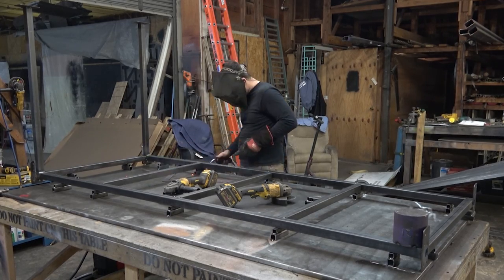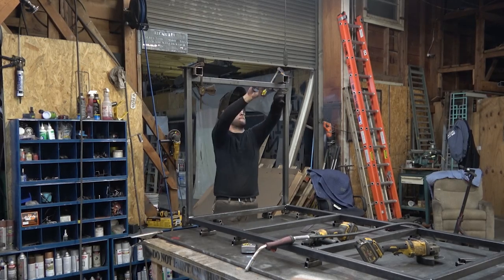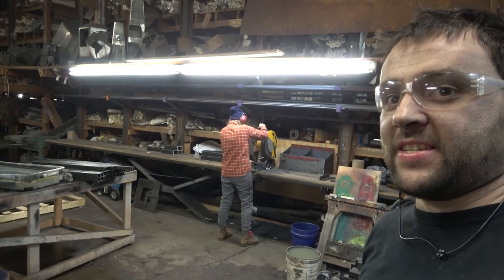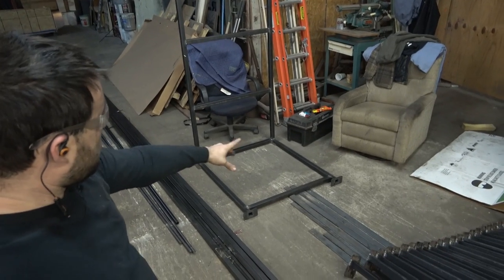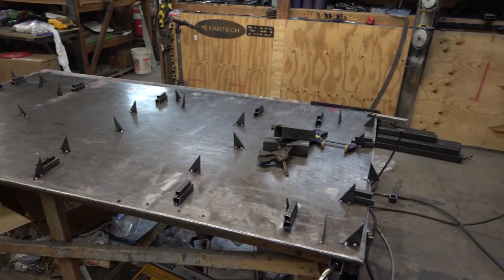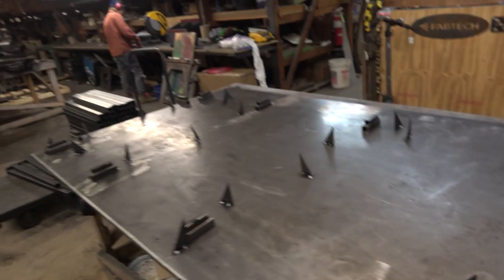I don't know how production welders do their jobs — I would go crazy. I love the variety of what we do. This process is perfect to let us have that variety in limited doses rather than dealing with something super repetitive. We finally got the jig put together for the final step of the assembly. Here's what we're making: basically the two L's we already built with six cross members. The jig looked like some sort of torture chamber, but it works beautifully. We cut out these little triangles in 10-gauge — an easy shape that you can jig up a couple different ways.